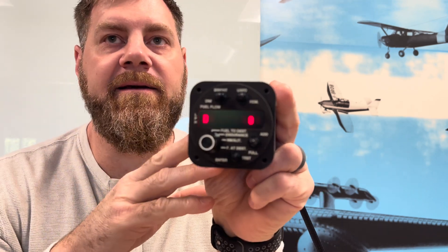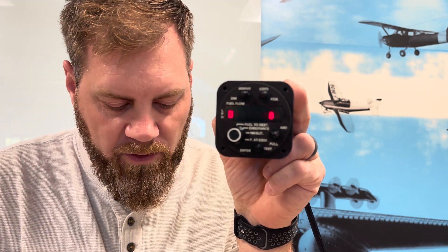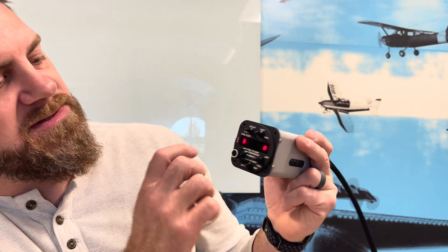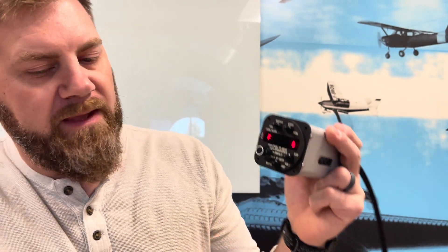The next value is 'D' as in Delta — this is your endurance warning time. From the factory this is set for 45 minutes. It takes the usable fuel based on your fuel flow and fuel on board, and if that time runs below 45 minutes in the endurance screen window, it gives you a low fuel warning. You can set this for 5, 10, 20, 30, or 45 minutes. Page 26 of the manual tells you what number is associated with each time interval. From the factory this is set to zero.